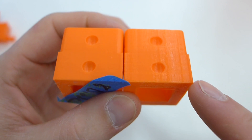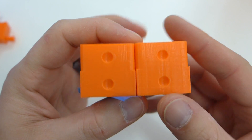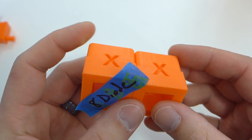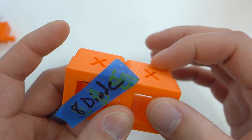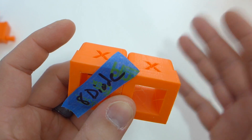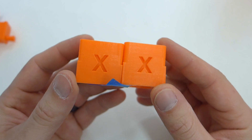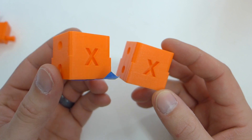Let's look at the eight-diode one now. Here on the right is stock, here on the left is the eight-diode. There is a drastic difference in the two — you can see how much smoother the lines are here, and you can still see how choppy these ones are here. It can't always be noticed, but you really can tell on bigger prints. This was just one simple way for me to try and show it. You get much better extrusions with the eight diodes or even the four-diode ones.